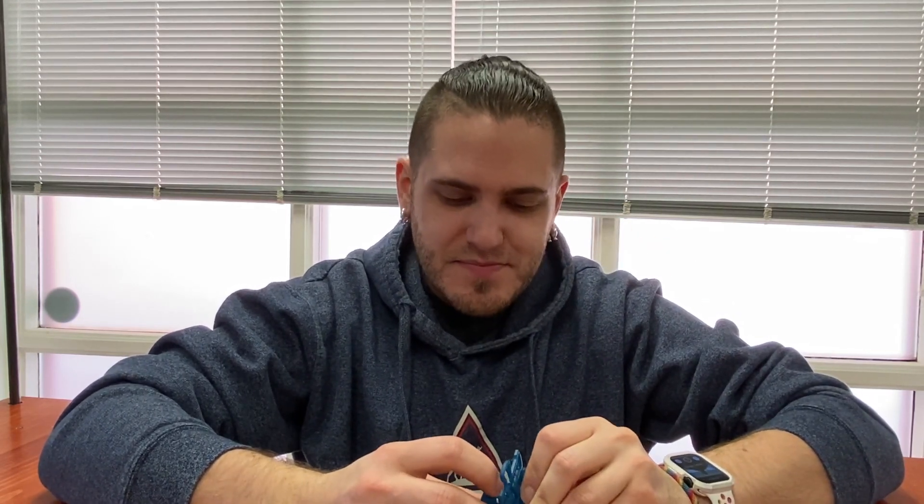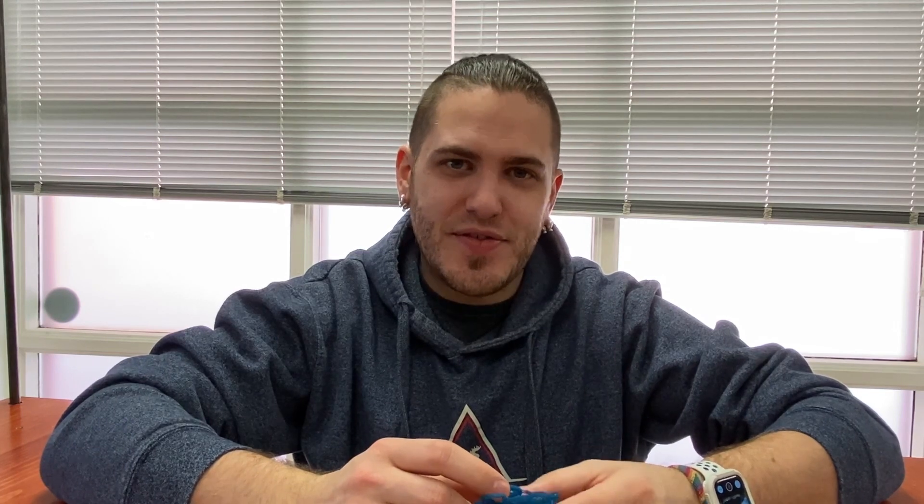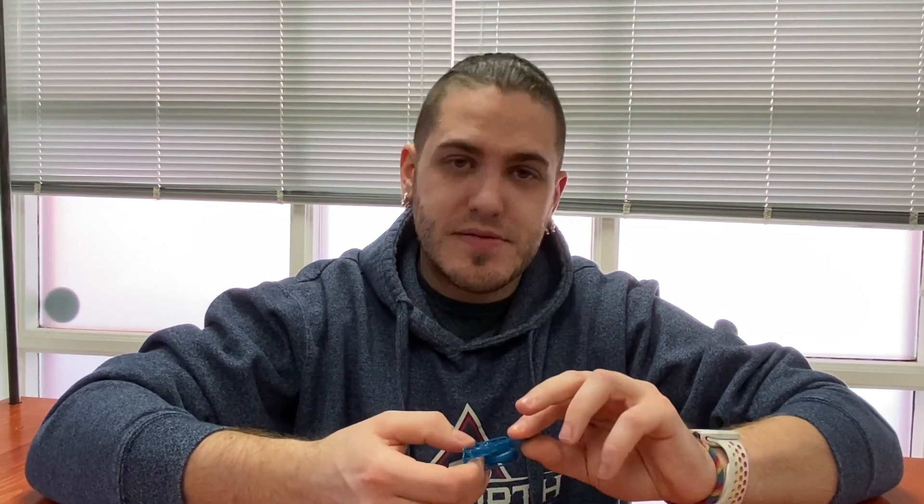Let's hope it lives up to its castability. I'm cautiously happy — if this stuff doesn't cast well, that's too bad because it prints so nicely. Let's get these sprued up and cast in bronze over the weekend. I specifically use silicon bronze; I've cast with it a lot, so it's not a new metal to me. I know how to get a good cast out of it with no porosity. Let's hope it casts well, and I'll show you that result next.